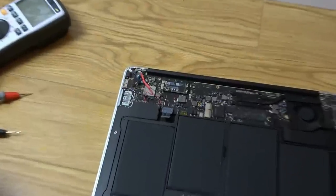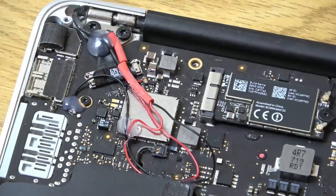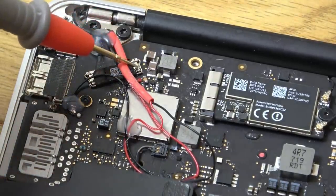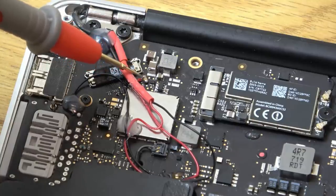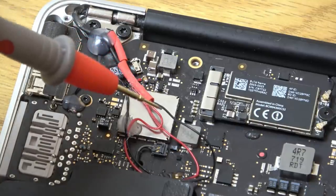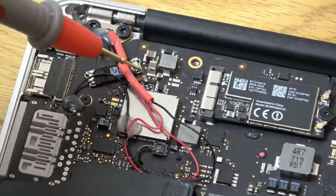That's what I'm hoping. A few hours later, and this monstrosity up here is now done. So initially I thought that that was an inductor. It's not, it's a capacitor, because this side of it here is actually going to ground. So it's not an inductor, it's a capacitor. So I've attached a red wire which feeds the two backlight pins, I believe, to the top of the capacitor.